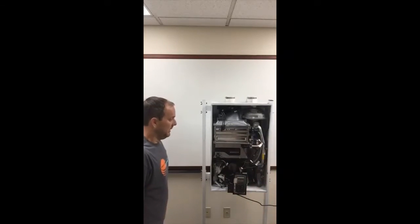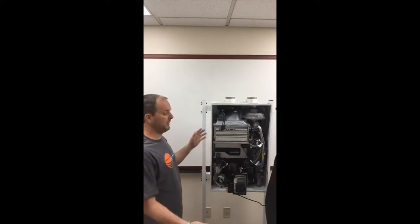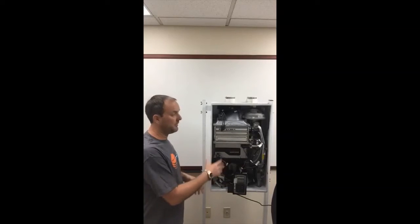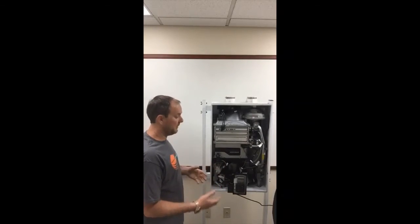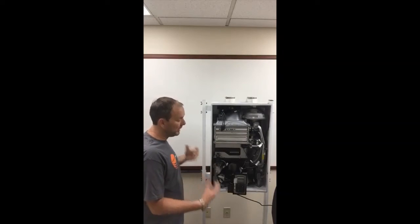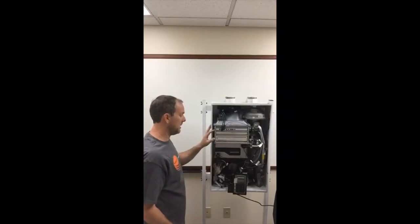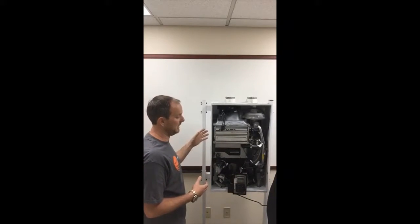That's awesome. Now, what about maintenance? What do you have to do to maintain this to make sure that it stays in good working order? Well, we all want to keep our manufacturer warranty, so I typically suggest installing a pre-filtration unit on this system. Okay. They're fairly inexpensive. It's a few $100s, and they really cut down on the maintenance. So this is the heat exchanger, and the nice thing about Navien is they use a high-grade stainless steel, higher than anybody else in the marketplace.